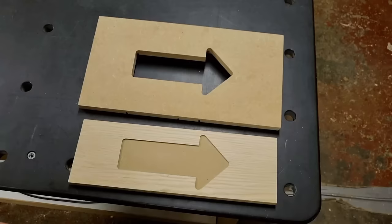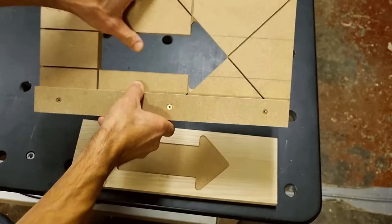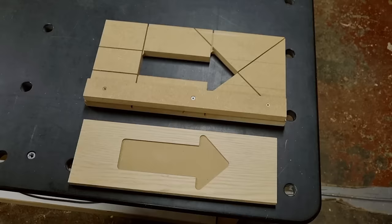A quick reflection on which side to use towards the workpiece: if you use it with the smooth side down, you have a smooth sliding surface for the router without interruptions, but you have small holes in the corners that won't give any tear-out support to the workpiece. If you use it the other way around, you'll have some grooves where the router can get caught, but you have full tear-out support in the corners. So it depends on the situation.